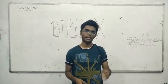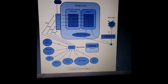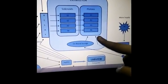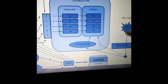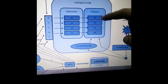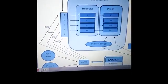It's an affordable and effective solution for such people rather than just a passive and supporting framework. As you can see, this is the block diagram of our project Bipex Exoskeleton. Pistons are the major components of our project. The actuation happens through pistons. The air that the piston requires is provided through the compressor, which also stores air on an onboard storage mounted on the exoskeleton. The switching of air flow inside the pistons is done using solenoids, which are controlled by the MyRio using relays.